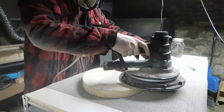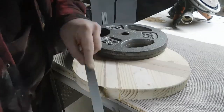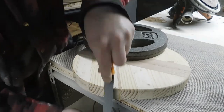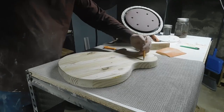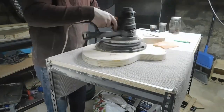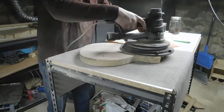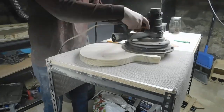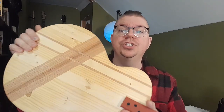Prior to the start of this video we sanded it to 80 grit, then I took a rasp to all of the inlay edges and cut them flush. From there I took a pencil and scribbled all over the whole body front and back, and sanded to 120 knowing that once all those pencil marks were gone we had thoroughly sanded that entire level of grit. Beyond that we did the same thing again sanded to 240 over a guide coat, and then started with a few quick coats of a two-pound cut of shellac.